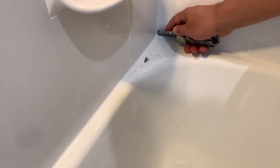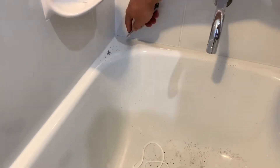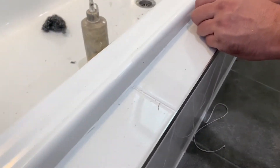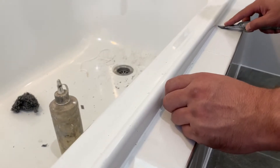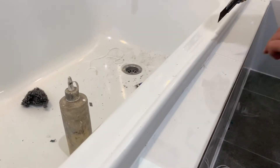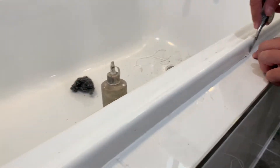There's still a bit of mechanical work involved and it requires a little bit of skill and a good eye. Alright Rob, this part here we'll have to trim away from that lip. So we'll cut the silicone just flat on the side of the tile and then trim it off the top. We don't want to dig it out — all we want to do is remove it off the enameled part of the bath. We end up with this, which later on we can just clean up with a little bit of sandpaper, a bit of steel wool, and she's ready for pouring.